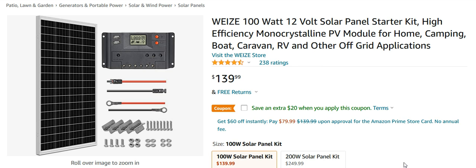Perhaps throughout the summer I may do some playing with this, but I thought I'd do a quick video now to give you some direction if you want to do some research. It depends on how much you want to spend. I've seen batteries — one battery, depending on how many amp hours it's rated — can go for a hundred and some dollars, depending on the type of battery and the manufacturer. You also have to consider how active this repeater is going to be. Is it going to have a lot of activity on it? That's another thing to consider when choosing battery size and solar panel size, as well as the standby current required when the repeater is not transmitting.